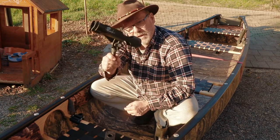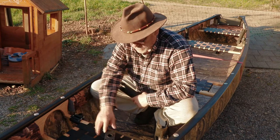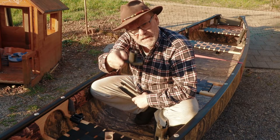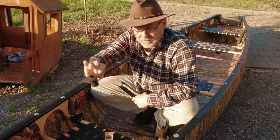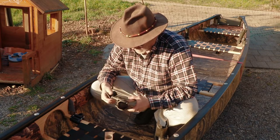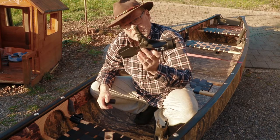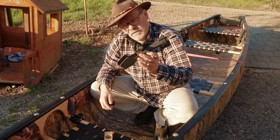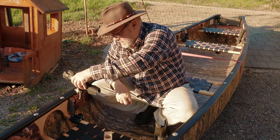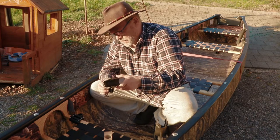It's composed of the upper part, which I think is fine, and the lower part, which is either this bracket or this type of bracket. This type of bracket cannot be mounted like this — it has to be mounted like this, which is problematic if you want to put it into a deck because you have to drill a big hole with 32 millimeters of diameter. The thing is constructed so that you can only enter it in one position where the notch is, so you really have to carefully think about how to do this.